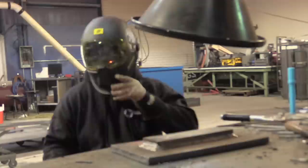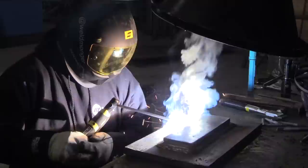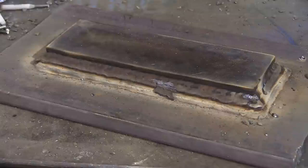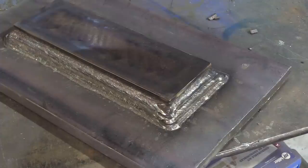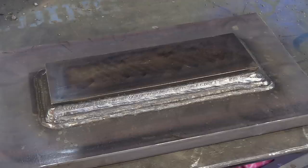This is a multi-pass weld. That first job I had, they were all single-pass fillet welds. But while I'm welding the rest of this out, it reminds me of how being able to run these big rods came into play even as a pipe welder or pipe fitter. I predominantly welded pipe, but there were certain times on jobs when the pipe systems might be finished and you had to weld pipe supports — a lot of heavy wide flange welded onto embedded steel and concrete, pass after pass after pass, having to avoid undercut, get it inspected, bought off on a visual. You never know what job you have is preparing you for another job. I thought that first job was the crappiest job ever, but looking back on it now, I really wasn't worth much more than they were paying me. It was free training and I was getting paid, and it helped me later on for higher-paying jobs.